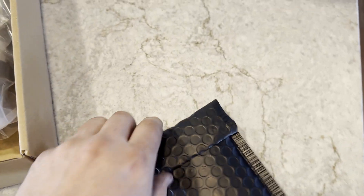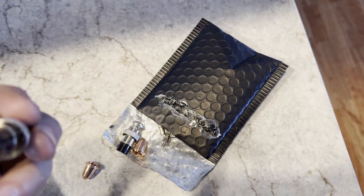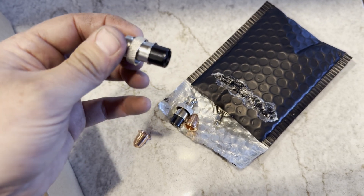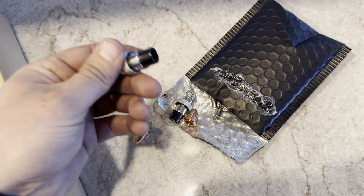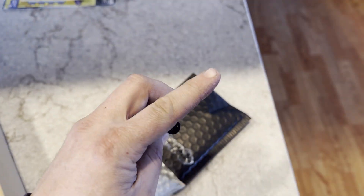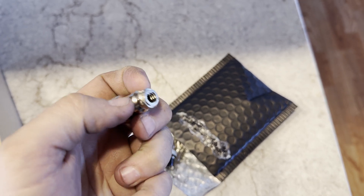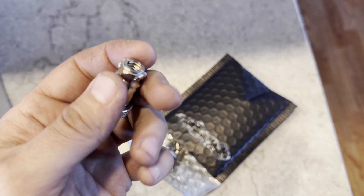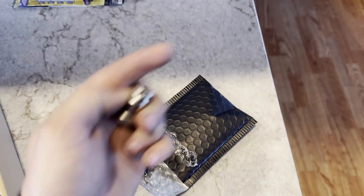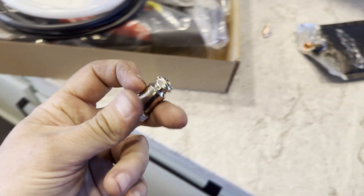Quick correction — that two-wire with the shield isn't going to the Z-axis switch; it's going to the CNC plasma cutter controller, if yours is CNC capable for the torch. It comes with the connectors here, so it's pin one and two to the torch itself. This is for the torch height controller and everything, which we're going to end up doing eventually. Basically what we're going to do is take that shielded two-wire I just built, and it'll come into this connector which plugs right into the CNC machine. Then we'll just terminate the shield at this housing — we can actually terminate it inside this metal housing, and it's going to be grounded on the inside of the circuit board, so it'll be a grounded wire all the way up and terminate right at the connector so there's no interference.